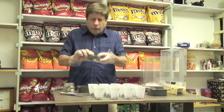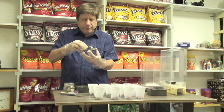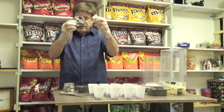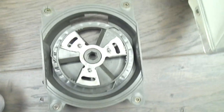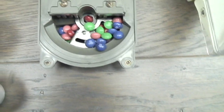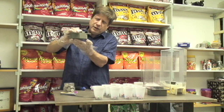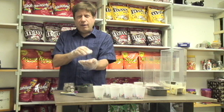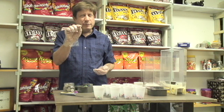Once you pull the wheel out, it has a little metal thing and you can change the amount that you give per quarter. There are a couple of screws that hold this in place. Once you set the size of pocket that you like, put it back in the holder, put the lid back on. Then put some candy in — let's do three cups of candy. Make sure it's connected and held tight, then start spinning the bottom. It'll start kicking out candy, and you can count the candy to find out how much this setting gives you. Right here, this is 12 pieces — so we need to make that pocket a little bit larger for this type of candy.